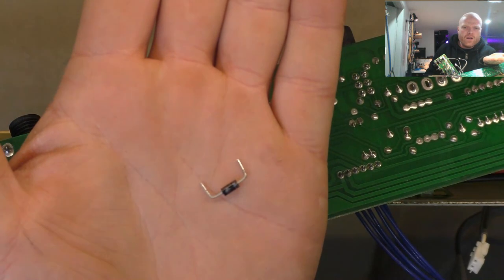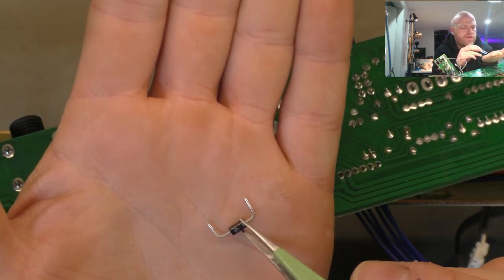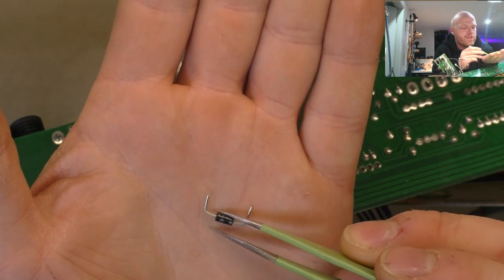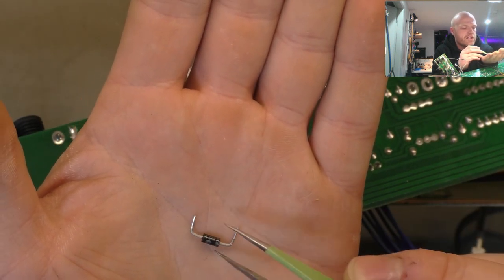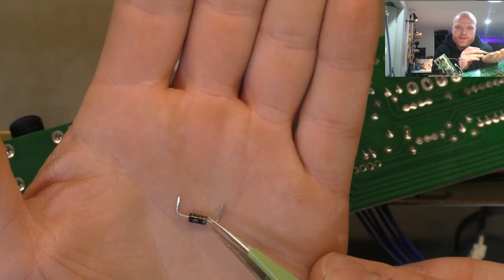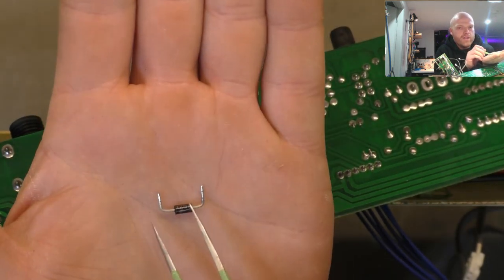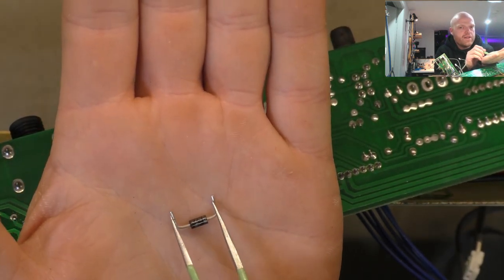They look like 1-watt, maybe 2-watt. I'll look up the data sheet, but yeah, I've got 5-watt ones, and their bodies are significantly bigger, so they can dissipate more heat. So I'll probably put some 5-watters in there regardless, and those leads will still bend down within that pad-to-pad distance.